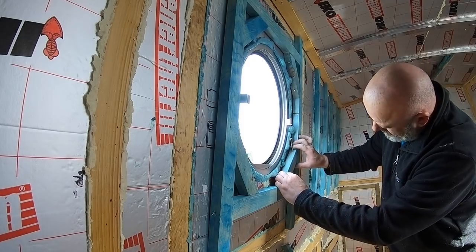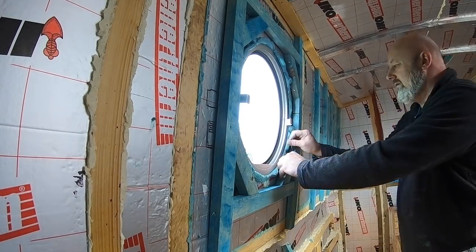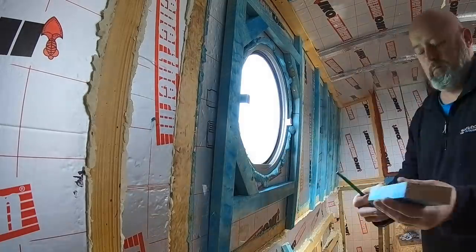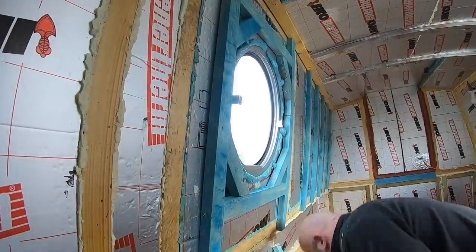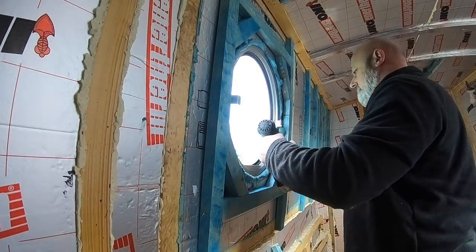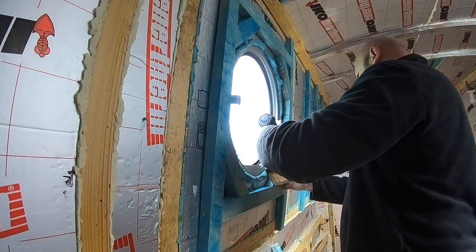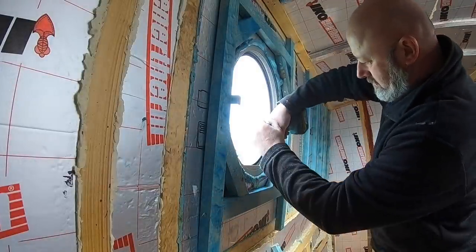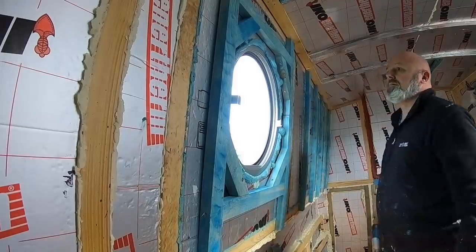There is a window liner that's going to go around there, which we're going to actually make removable as well. So it'll just be a case of taking the liner out, undoing the clips with the screws, and then the window should come out from its place, so that then we can paint the boat and then refit the window and attach the window liner.